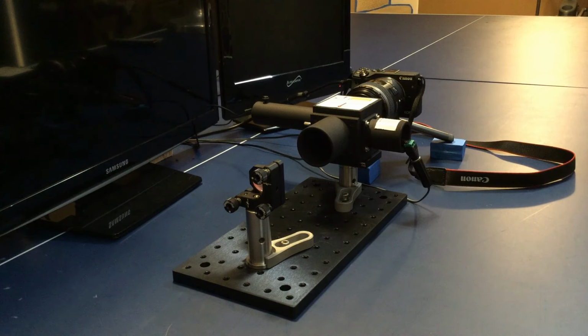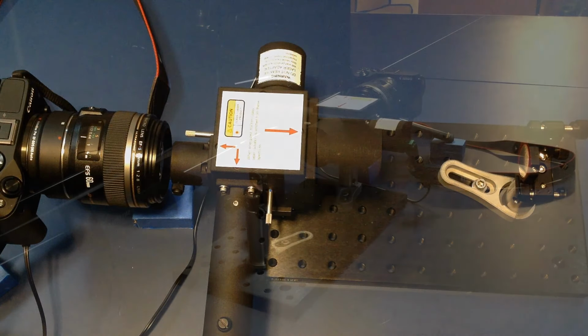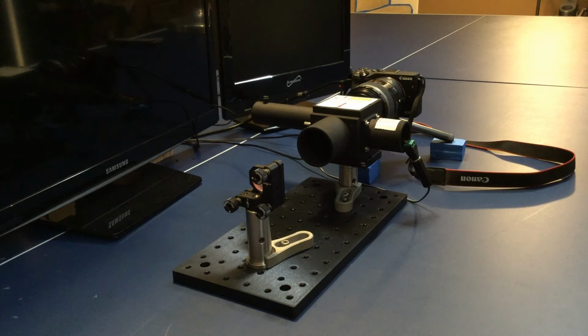If the return beam significantly overfills or underfills the 1/4-inch hole, it will be necessary to adjust the distance of the test mirror from the SPPDI so that the return beam is about the same diameter as the hole. When the beam returned from the test mirror is centered over the 1/4-inch hole, it will be possible to begin observing interference fringes.